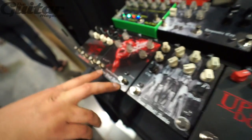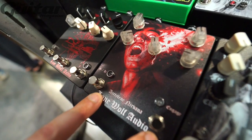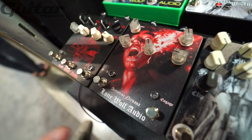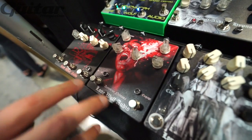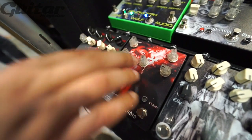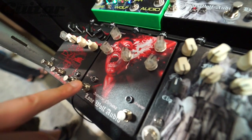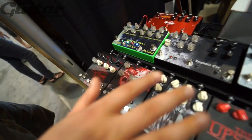You've got the Acetylene Nirvana, which is a filter sample hold — it's all analog, OTA-based, really neat. I did a new version of it that took a lot of noise out, because some of them were noisy. I got a new transistor for the sample hold function that allows it to self-trigger on this board, so you can actually turn it into almost a modular synth.